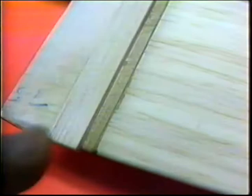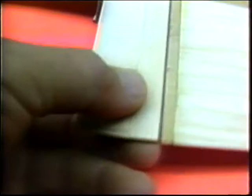Now I'm trying to set this. A machinist ruler is real handy to have. Make sure we have that double the thickness of a piece of 320 sandpaper right in there. That'll allow for the paint buildup. And of course, make sure it's nice and smooth. And of course, I didn't get the other one done yet, but make sure they both match.